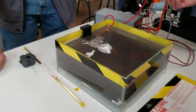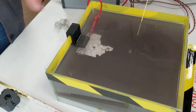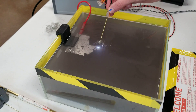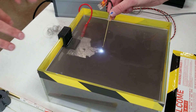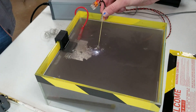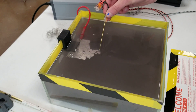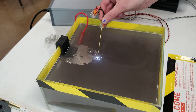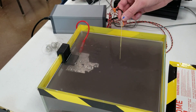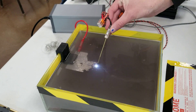This is a $600 tool. What's happening with this? We're vaporizing the metal. We're also vaporizing the tool you're holding a little bit. We're stimulating thousands and thousands of little lightning bolts between the work material and the tool material every second — that's what that plasma is. This is electrical discharge machining. Those electrical discharges are what's vaporizing the material. We're able to cut any conductive material: aluminum, stainless steel, hardened steel, titanium, tungsten carbide — anything electrically conductive you can vaporize.